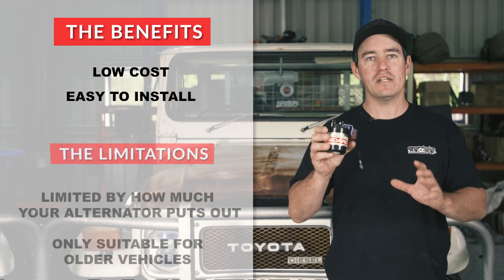The first stage, it puts in big current to charge fast and get it to about 80%. The second stage, it'll reduce the current and increase the voltage, which is exactly what a deep cycle battery needs to get 100% charged. When your battery gets to 100%, it changes its state of charge to something called float charging. What that basically means is it trickle charges a little bit of voltage and current into that battery to maintain 100% charge, so you get your full amount of amps whenever you like. But more importantly, it protects your battery from overcharging, so your battery is going to last longer.